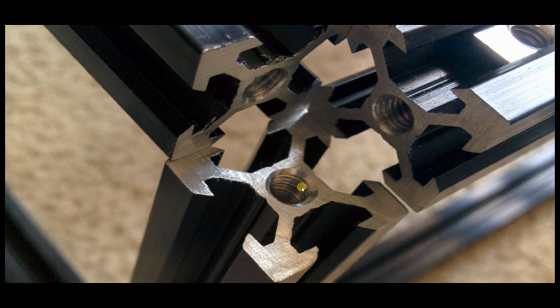And even by hand, it's probably a good idea to use cutting oil because it just makes it so much easier to tap the threads. Aluminum's not easy to tap. It's soft, but it doesn't like cutting threads. The aluminum starts clogging up the bit, so you have to tap a quarter inch down and then back it out and run it back in again.